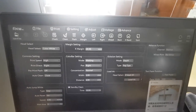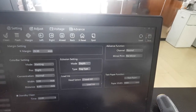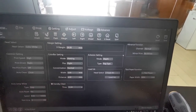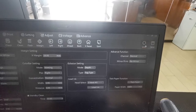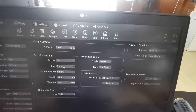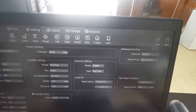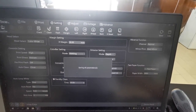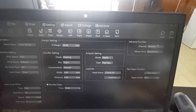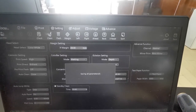After we know all the functions of the control software, at the top right there is Load and Save. When you first open the control software, you need to click Load to load the parameters into the software. Each time you change a setting — for example if we set the waiting option — you must click Save to save the parameter to the mainboard. Please remember, each setting you change you must click Save.